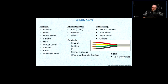And if you remember, maybe with me or some other subjects, you were talking about how coils like change. Capacitors like change. They love change. They will pass the change through. Coils or inductors do not like change. They will not pass the change through. If there's a sudden change, a coil is going to oppose. And the more sudden and drastic the change is, the more sudden and drastic the response is going to be by the coil.